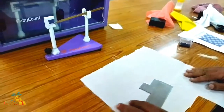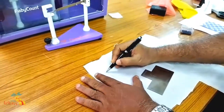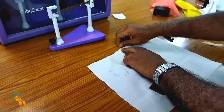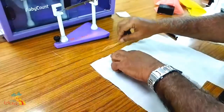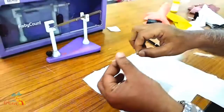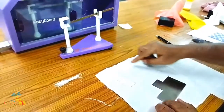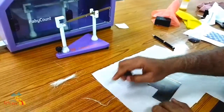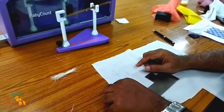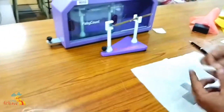Now you have to prepare the samples. I am marking - this is the warp direction and this is the weft direction in the cloth. If I am going to unravel the yarn from here like that, you have to unravel like that in the fabric. This is the weft yarn I am getting. This is the weft yarn. Similarly, in the warp yarn also, you unravel and keep it separately. Don't mix the warp and weft yarn - keep warp separately and weft separately.